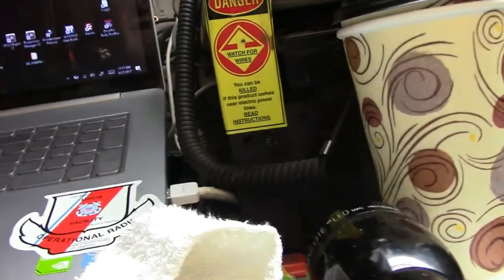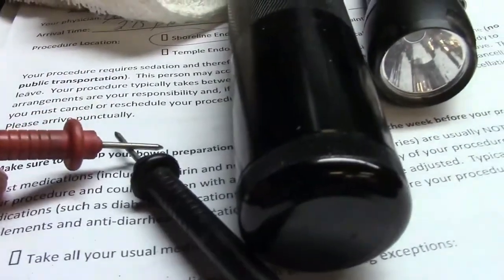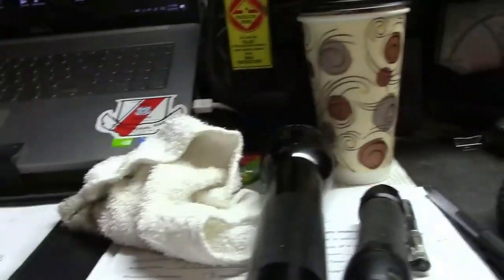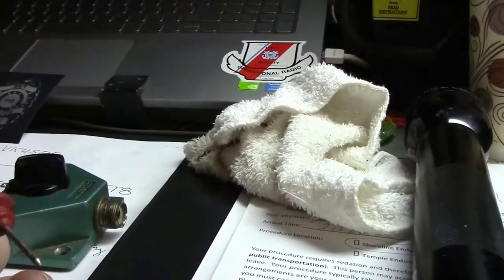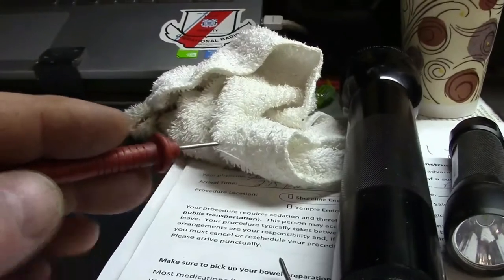That's Coast Guard — turn that down for a minute. That's how you check: if I have that sound, that means I have a connection or continuity from one point to another, like checking a piece of wire. With coax, it has two wires — the center and the shield — and I don't want the two to connect. So if I go from shield to center and I get that tone, that tells me I have a short. I wouldn't want that.